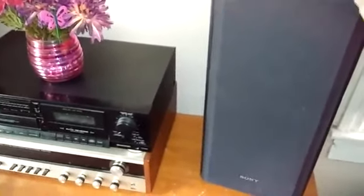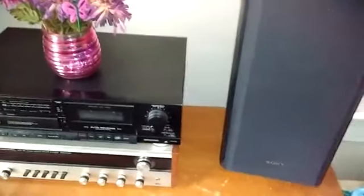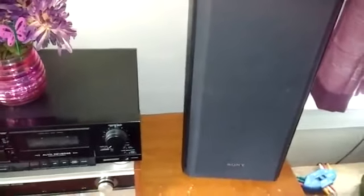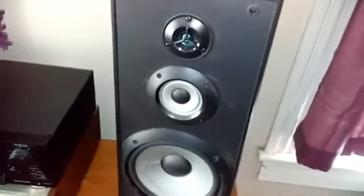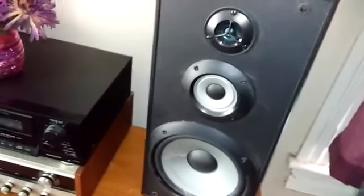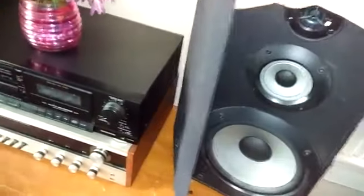These are the speakers I had been using for a long time — these are Sony B3000s. They're all right, but they're not near field, so it's not good to sit right close to them. They are a little boomy for my tastes. They've got lots of bass, but it's kind of boomy bass. Three-way speakers, though there's not actually a real crossover built in — Sony took some shortcuts. These sold for probably between $100 and $200 when I bought them. There's just a capacitor that keeps the low frequencies out of the mid and tweeter. They don't sound too bad, and I guess if you just like it loud, you're alright — because they are pretty loud.